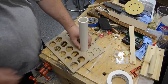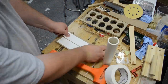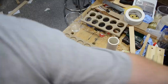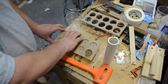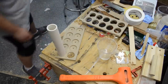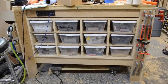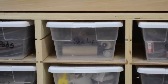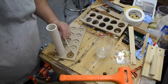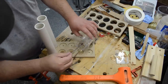I ended up with ten identical-length pieces, which was perfect. Most of my little stock was gonna be 12 inches long. I was gonna epoxy the PVC into the non-through holes, but since that pilot went through, I laid down some gaff tape — you can use duct tape — so the epoxy wouldn't spill out. Of course, my very first one I spilled the epoxy anyway. I then tried to get the epoxy into the corners and a popsicle stick wasn't doing it, so I reached into one of the bins under my workbench and grabbed an acid brush from my glue-up bin — it's got brayers, syringes, acid brushes — and I was able to push the epoxy all the way to the edges before it set up.